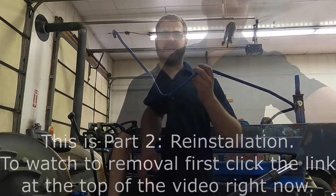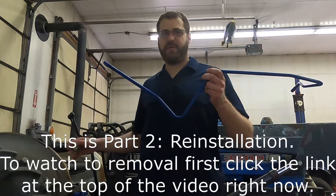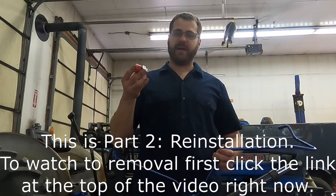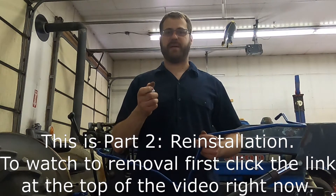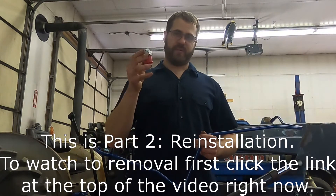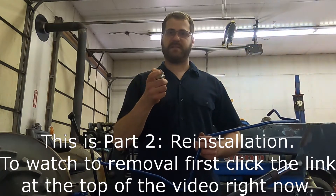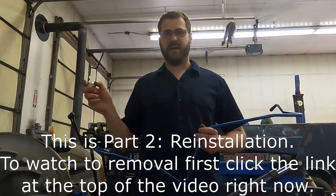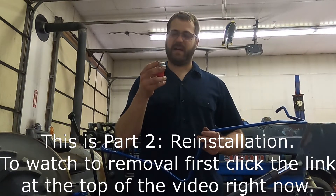Welcome back. Today I'm going to be replacing the hydraulic pressure feed line from the hydraulic pump to the rear axle of this Ford 3000 tractor, and more importantly the fitting that actually threads into the rear end of this tractor. Normally this is not a wear item. The fitting — a compression style fitting — was cross-threaded into this larger nut on this particular tractor, and there's no way to get it to stop leaking after that happens.